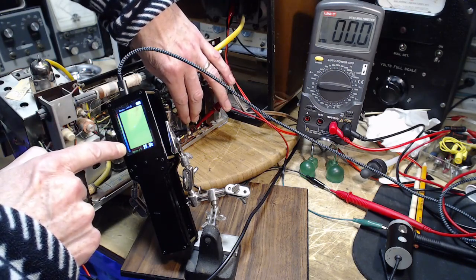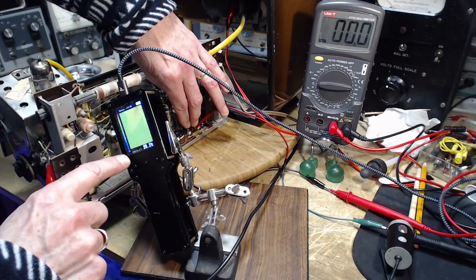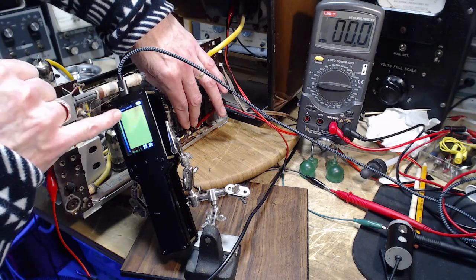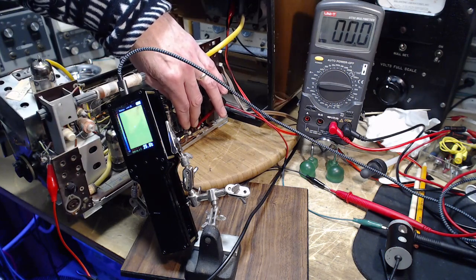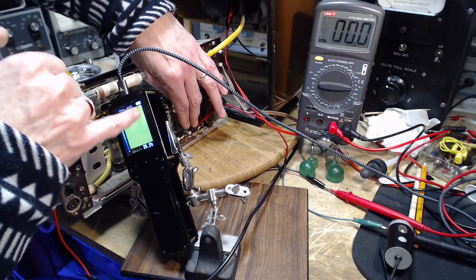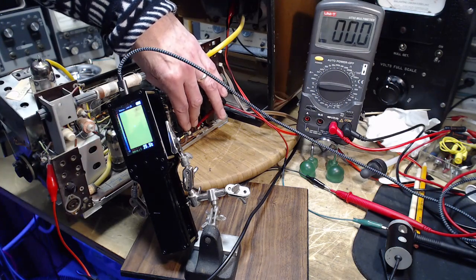Now then, you can't see it in the camera, but there's a little number written here in red that shows the highest temperature. Like right now, the highest temperature on the screen here is 28.5, jumping around my finger. You can't see it, but there's a little red plus sign. There's a white one fixed in the middle. Then there's a red one bobbing around marking the highest pixel temperature, and another one over here bopping around marking the lowest temperature. It's really a neat instrument.